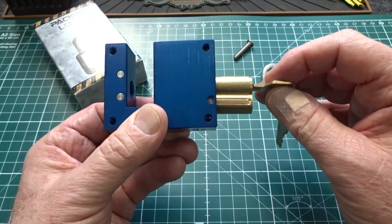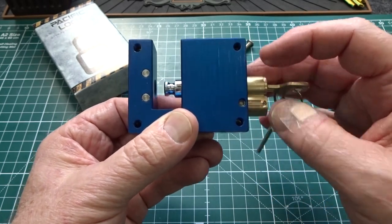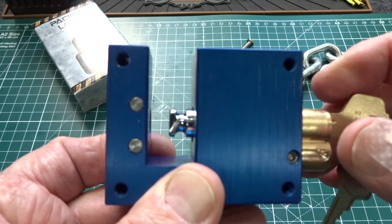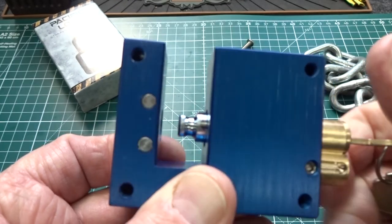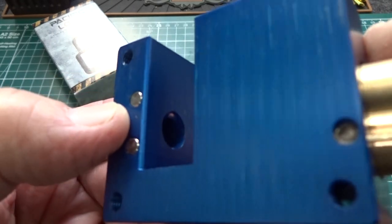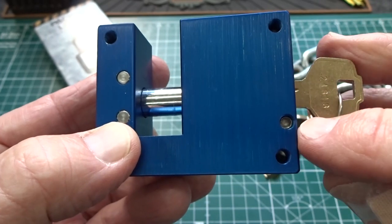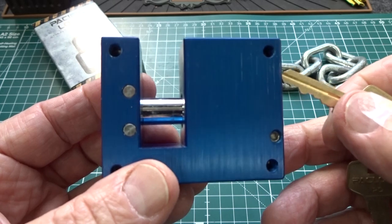If we get it picked we'll go ahead and take that screw out, but a lot of people say 'if I remove that I've defeated the lock' — and that's just not the case. If you take a look at the shackle right now it's in the unlocked position, and when you rotate it you'll notice it's got some little wings that pop out. Those little wings engage with two hardened steel pins. So even if you were to remove that screw, you're not going to defeat the lock.